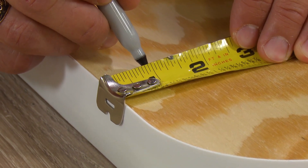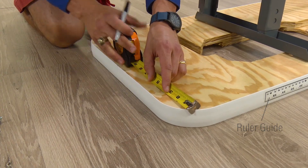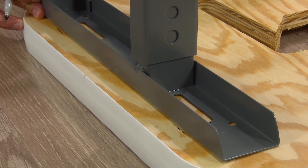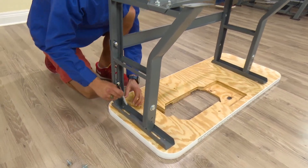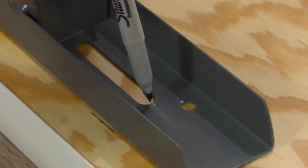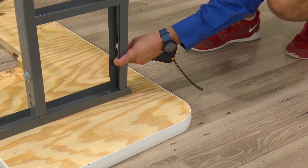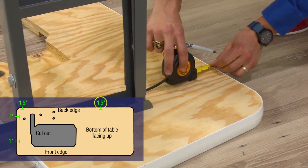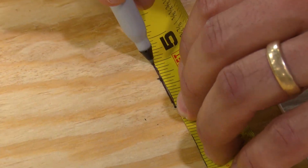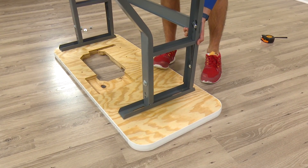The front edge of the table has the 36-inch ruler affixed to it. Using those marks, position the K legs as shown here in the video. Take note of how the K legs are resting on the table. Then mark the slotted openings where a screw will be inserted. To ensure that the opposite K leg is straight, measure in one and a half inches here as well and place a mark. Then place the K legs at that mark, ensuring they are straight, and mark the slotted openings.